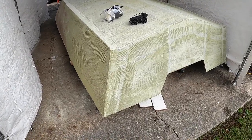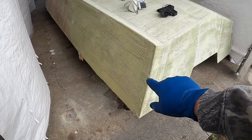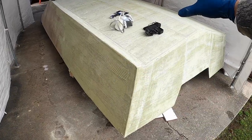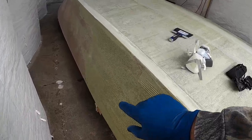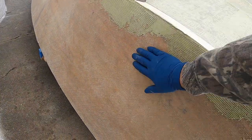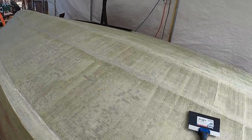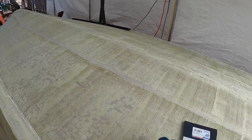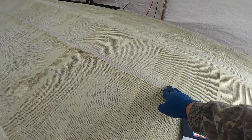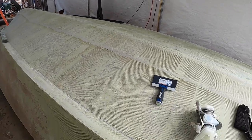Today I'm going to come in where I put stuff on the sides - I did that with what I had left over from doing the bottom. As we go forward and get up into here, I'm just going to put a skim coat on this because it's all pretty fair and rounded. The reason I did the bottom of the hull the way I did is because I had a pretty proud lip right here where that fiber gets. I probably could have just skimmed it, but I chose to do it this way and I'm going to see what happens.